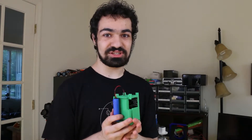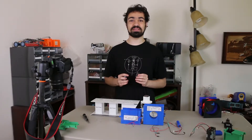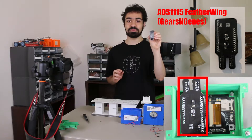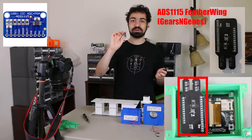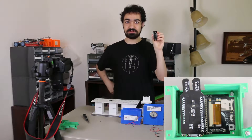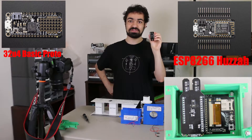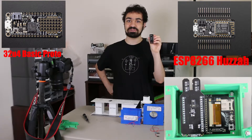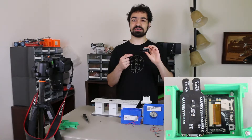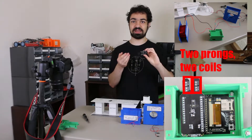Let's take a look under the hood and see what actually makes the advanced EMF meter more advanced. The first thing you'll see when you open it up is a PCB that looks like this. This is a featherwing that I custom made as a board for the ADS-1115, which was originally a breakout board produced by Adafruit Industries. This featherwing is designed so that you can directly plug it into any other feather or featherwing — like the 32U4 or the ESP8266 Huzzah — so you can stack these up into gradually more complex circuits without worrying about the direct connections themselves. Unlike the previous EMF meter, which could only connect to one coil, this PCB allows you to connect to two separate coils, with each prong having two terminals which you hook each terminal of the coil up to, as seen here.